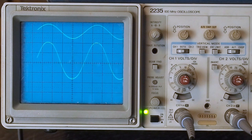There's nothing wrong with that. I have an SE amp with these small output transformers. I think we're doing fine. And that's probably 90% of the volume. I mean, we can go into that. There's full volume. So it just goes into clipping at full volume. So we know on a line-in source, we can use 90% of the volume control without going into clipping.